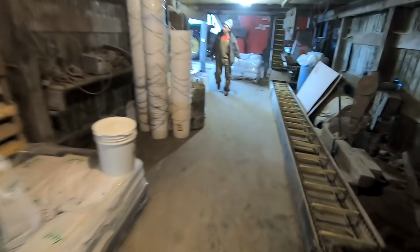We got this big log conveyor in our feed room that runs along the four silos, and we had put a new chain on it a couple years ago, I guess. Over time, as it starts to wear, it stretches. You gotta take a link or two out so that it keeps working right. We're gonna take a link out right now. So we're gonna use this come along here and we'll make some slack so we can take a link out. Go ahead.